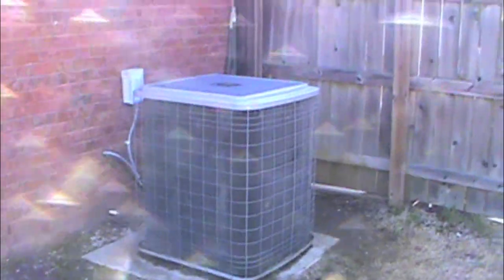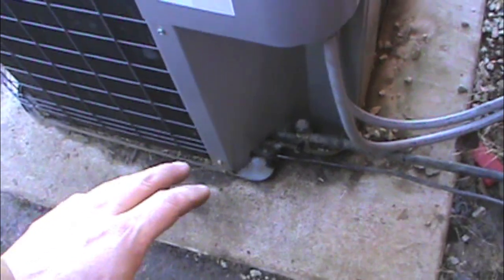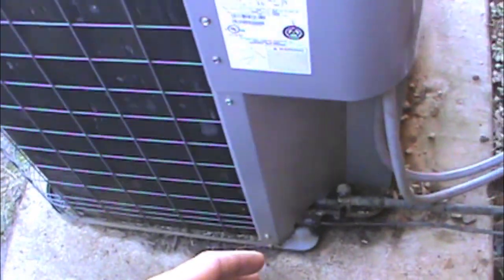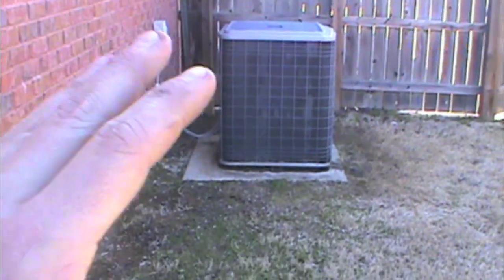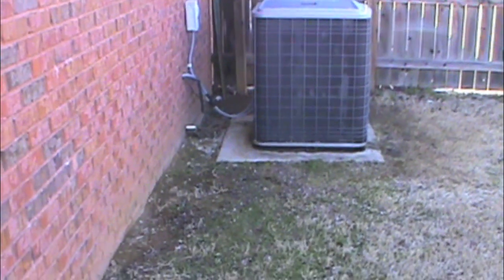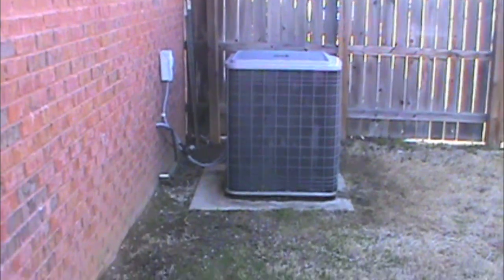All right, I just wanted to mention — I didn't get a lot of footage of sweating in the valve or anything, but I should have, and I didn't. We ended up going, and our pressures were about 200 on the high side, 70 to 75 on the suction. It's not as cold today — we're probably about 60 degrees out here. In cases like this, where it's an intermittent problem, we don't know exactly and can't nail it down to exactly what it is.